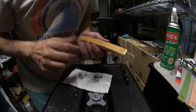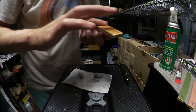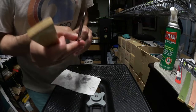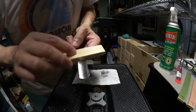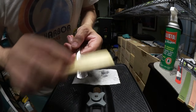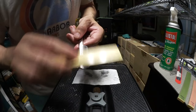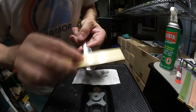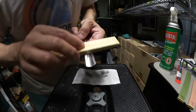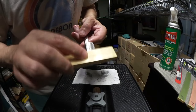Enough of the 1000 grit. Let's polish it off with the 1250, and then we will go for the transition to the finer stones. At this point, I want to be very thorough in making sure that I've really overtaken that bevel, because the factory straight razors from anybody in the Western world can take a lot more concavity than the straight razor makers are putting into the razors.